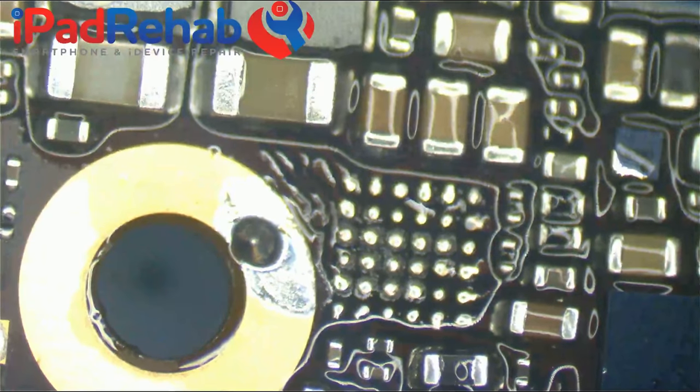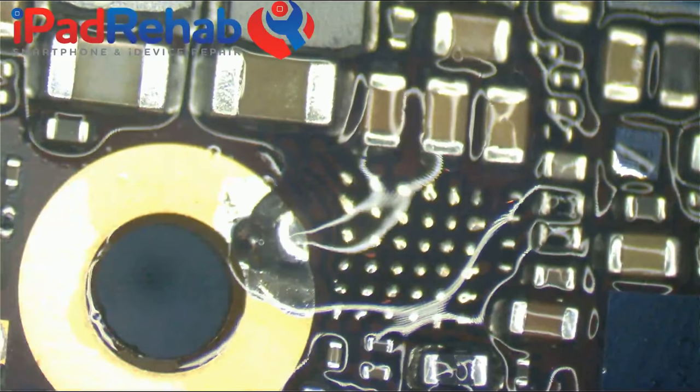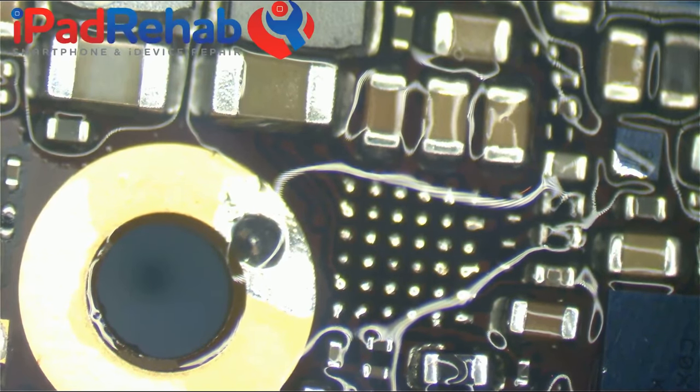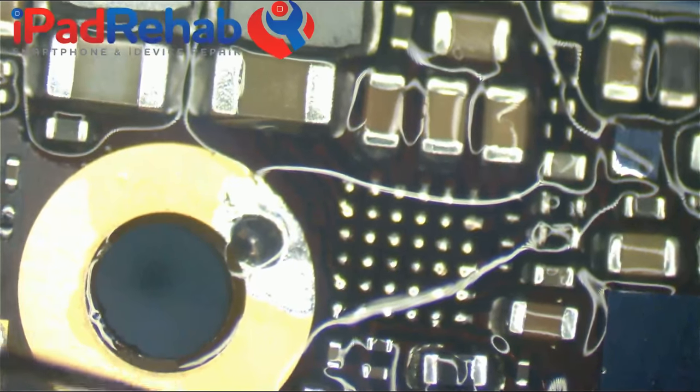And that's as opposed to the 6040. The 6040 is going to have a plastic range, meaning it's going to be kind of in a mixed state. Some of it's liquid, some of it's solid, through a range of, I don't know, something like 10 degrees.